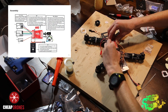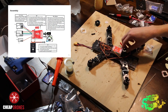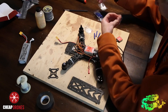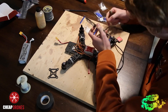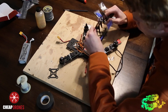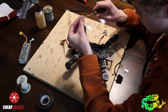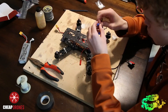If you need help with the Naza software, there are plenty of videos and there will be one linked in the description below. After you have the top plate on, place the Naza LED wherever it will be best visible when you're flying. Take the aluminum spacers and screw the top plate into the main frame with the spacers in between. Finally, take the last aluminum spacers and screw them onto the bottom of the frame to use as your landing gear — then you're ready to fly.